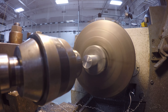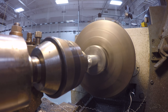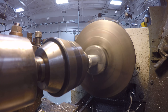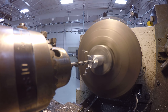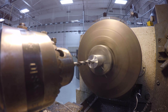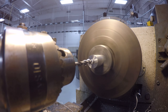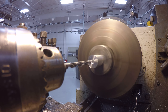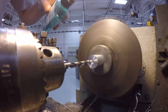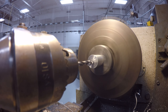With the threaded piece for the outside completed, I need to spot drill so that I can get started on the body of these mounts. I will go ahead and put a quarter-inch drill through this thing, all the way through the body of it, so that that forms the basis of the hole that the screw will go through. It's a pretty nice hole for my larger drill for the quarter-20.